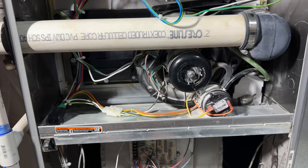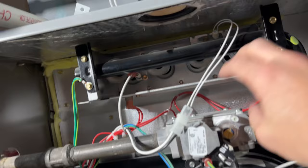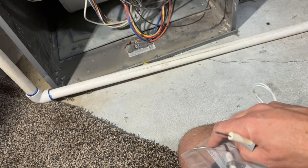Put your panels back on and flip your switch back on. There are also a couple of things up here you can check — your flame sensor and your igniter. These are two things that you can replace; I always have an extra on hand in case they're not working. The flame sensor detects whether or not there's a flame present, and the igniter ignites the gas in the air.